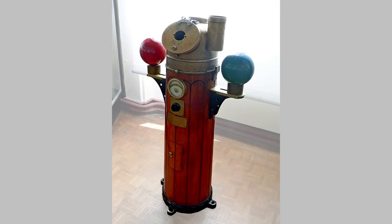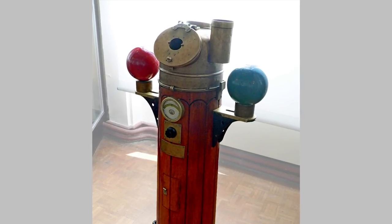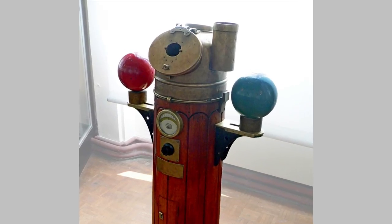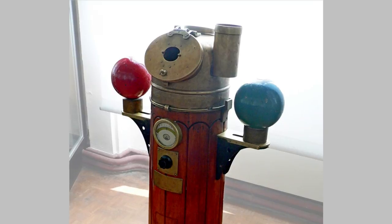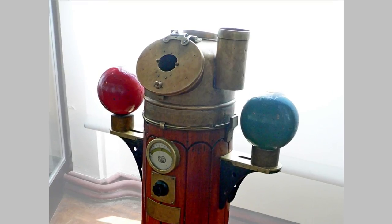First of all, let's talk about compasses in all sorts of craft. You've probably seen pictures of compasses in ships. Ships have got a lot of metal around them, and it tends to really move the magnetic field around. That's why Lord Kelvin invented the so-called binnacle that has two steel balls — those balls can be moved to basically make the compass think it's surrounded evenly by metal so that it will read correctly. Note the size of those balls — they're huge, and that's because ships are huge. They have the same thing in aircraft compasses, except the little bits of metal are really tiny.